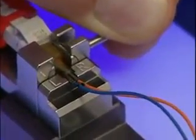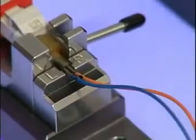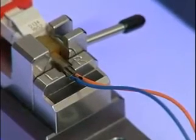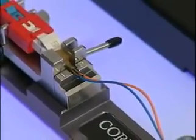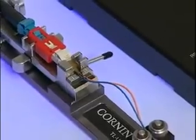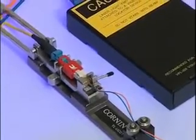Inspect the area where the red light near the vicinity of the cam was observed earlier. This light should significantly dim, but may not go out completely. If not, then uncam the connector and pull one or both field fibers back a couple of millimeters. Roll them in your fingers and then reseat the fibers. At this point, recam the connector. If the red light is still showing, then uncam the connector and pull the field fibers out. Re-cleave them and try again.